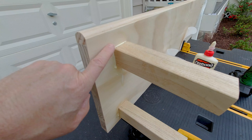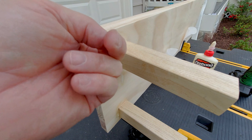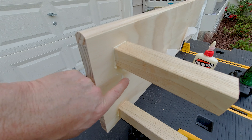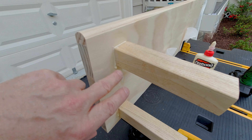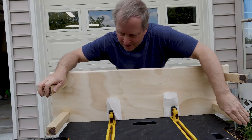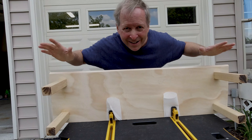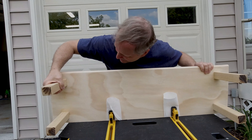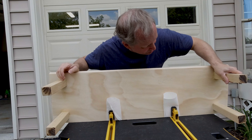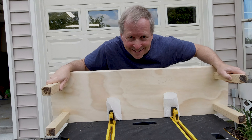On this one I added a lot more glue — I can always wipe it down, but that really seals the deal. Just running glue down all the sides. It's easier to wipe it off and have too much than too little. Now all the legs are on and it's rock solid. I'm really happy with how this turned out. I'm going to let the glue dry, but between the screws and the glue you could stand on this stand.